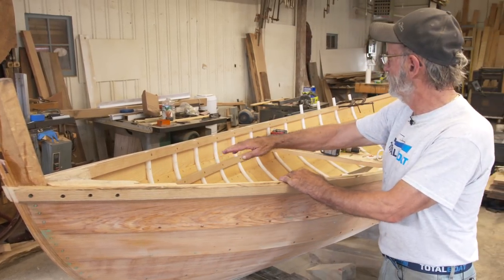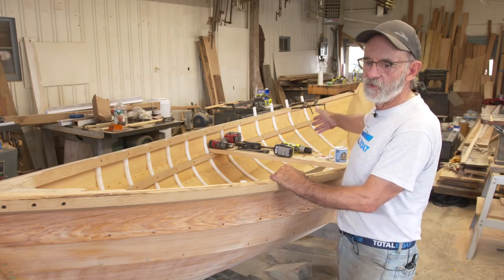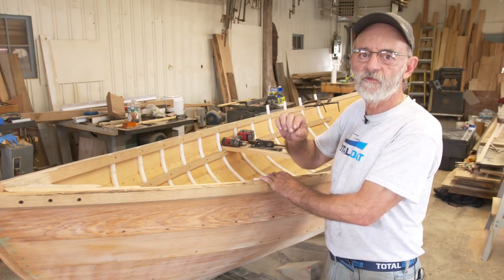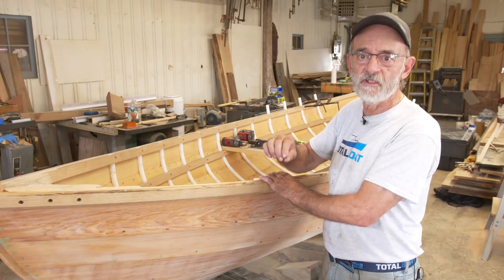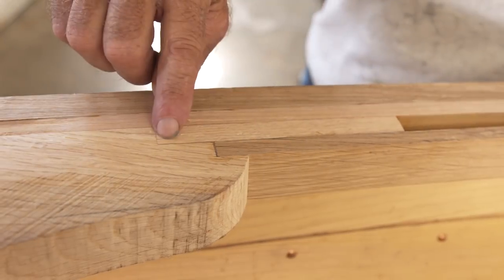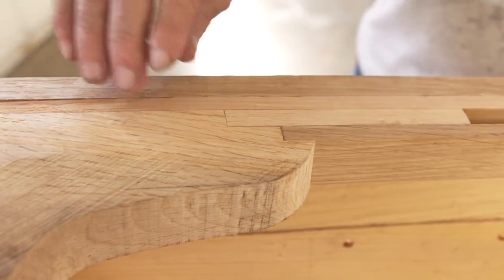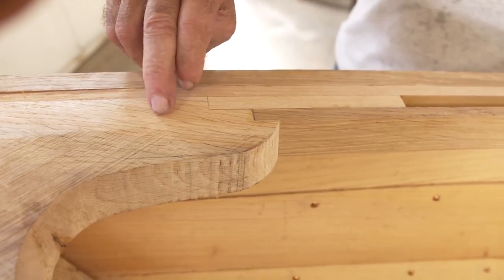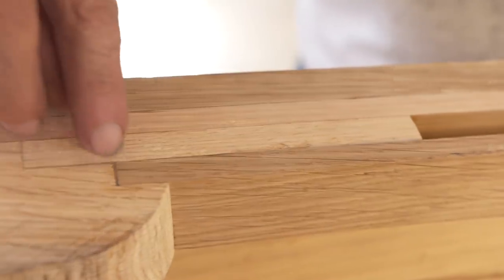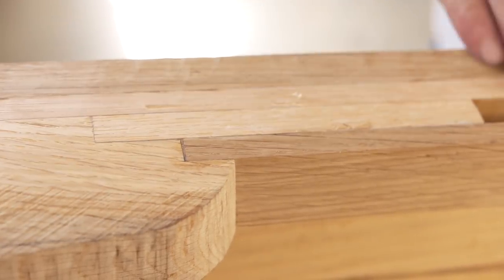You have to bump the in-wale into the breast hook and clamp it into position, but then it's too long and sticking out the stern end. You have to figure a way to mark it and cut it off the right length — leave it maybe a little bit too long so you can do what they call a saw fit. I want to show you what a saw fit looks like when it's complete and also how to do one. The breast hook is done a little differently than most — there's a little block of wood I put in first, which helped me fit the breast hook without clamping. The in-wale goes inside the breast hook, giving it a nice finished look.